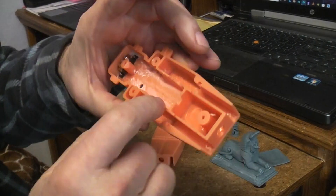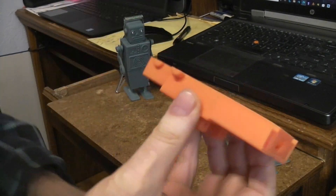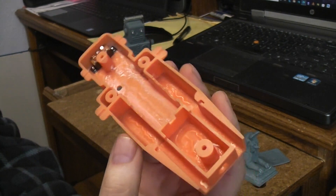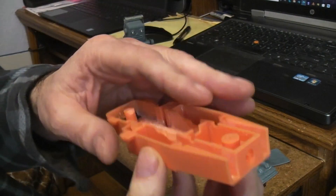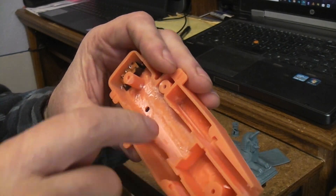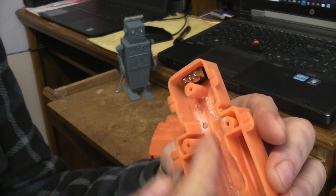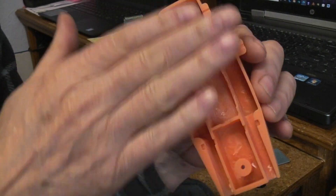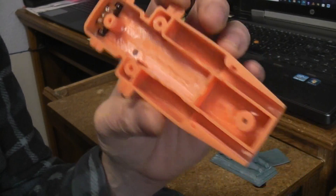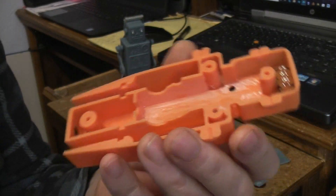When it gets pulled it stretches, and then when it comes back down it kind of reinflates that really thin layer of resin. I printed these at 0.1mm, and even at 0.05mm it just would have made it thinner. It makes a little bubble and grabs a pocket of resin, so this whole area becomes bubbled up. When the part is done printing I have to go in and scrape out as much of that balloon-type area and get the resin out, cure it, then go back in with a Dremel to finish the cleanup — adding a whole lot of hand labor. Also there's some Z scrunch that seems to happen on resin printers.